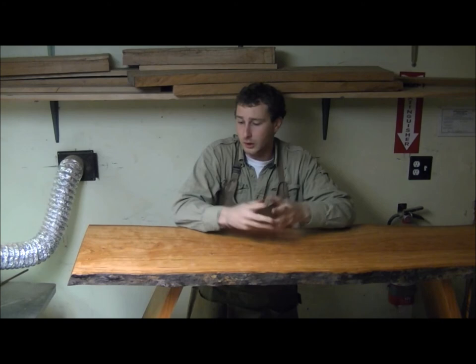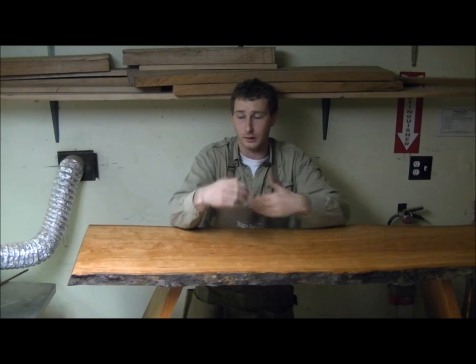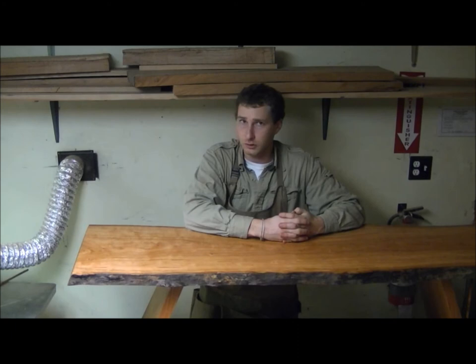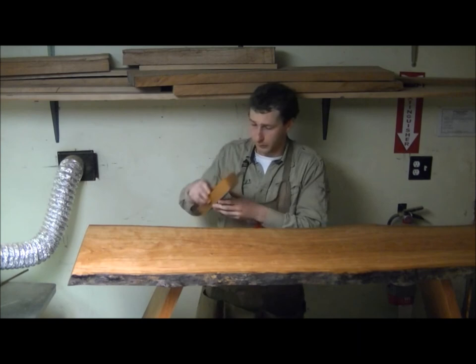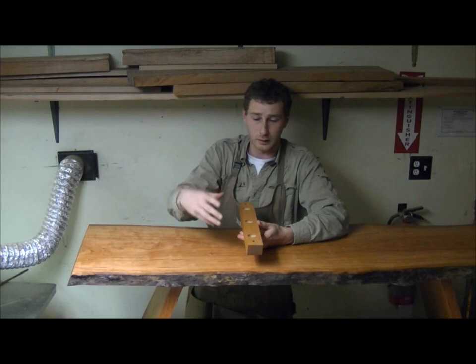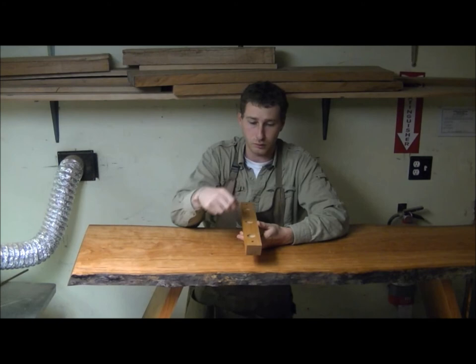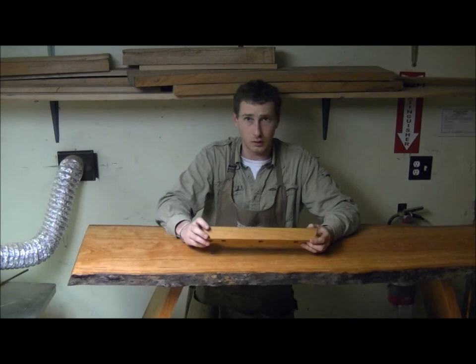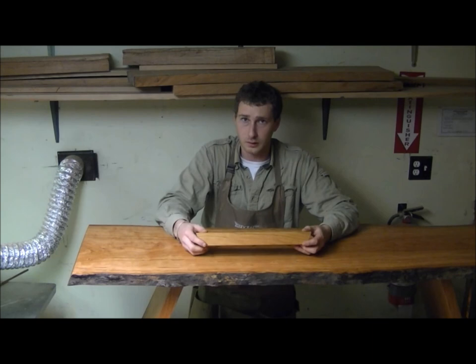Traditionally, with legs like this and the top, the grain direction is running the same way, so they expand and contract with each other, which means it could be directly tenoned into the top of the legs. That's fine for a coffee table — it's a very strong joint. However, it's not strong enough for a bench. So what we devised is a kind of go-between piece that sits underneath the top above the legs. There are threaded inserts into the leg, and a bolt goes into each threaded insert — three of them across the top of the leg. That prevents warping but still allows for expansion and contraction, with oversized holes on the two ends. There are also threaded inserts in the top on the bottom where this piece gets bolted in. It's stronger than lag screws, which use wooden threads — the threaded inserts won't strip over time.